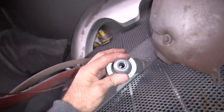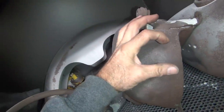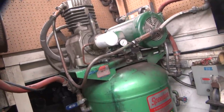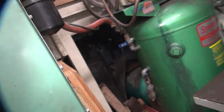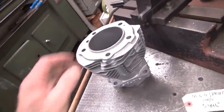It takes like 120 PSI to make it start shaking good. It does its big bellows bags and it's shaking — that separates the bad from the good. When you open up the nozzle on this thing you get a lot more air volume coming out, it draws a lot harder on the beads, you get a lot more bead volume — so instead of blasting a small area you're blasting a bigger area. It does a much better job cleaning parts but it sucks a lot of air. That's why this air compressor is too small even though it's been hot-rodded. I need my 10-horse air compressor at the other place, which is why I got that big phase converter back there.